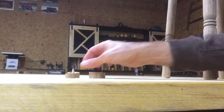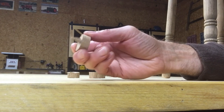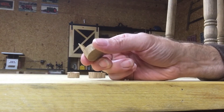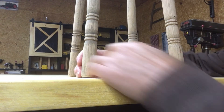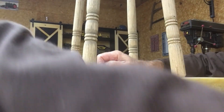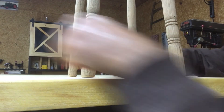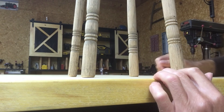When you cut these legs, just take your time. Hopefully you don't get tear out like this one, but if you do get tear out, don't panic — it's not the end of the world. If you do take your time, they come out real nice and clean like this one. But if you do get some tear out, it's going to be okay because on the legs we're going to want to chamfer the bottom anyhow, so that when they slide across the floor, it doesn't eventually start to peel away. So make sure you chamfer the bottom of all four legs — which I did already. When you chamfer them, as long as it's not a very bad tear out, it just gets sanded right away and you can't even see where it was. And as you can see, they're all four nice and level now.